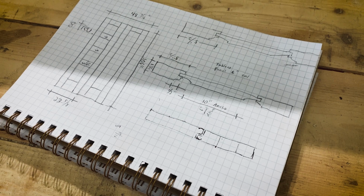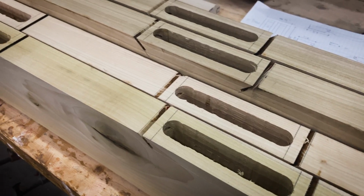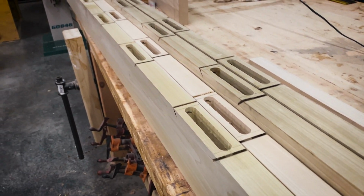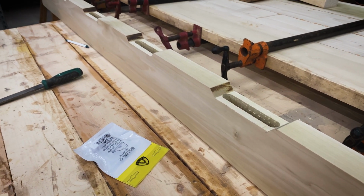The strength of joinery has to do with the precision of the fit. Now that the box is cut, the tenon on the cross pieces needs to fit exactly and tightly. Wood glue is strongest when there is friction between the wood pieces being glued together.